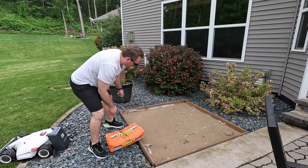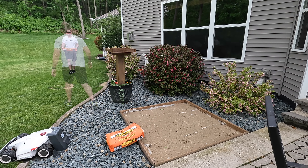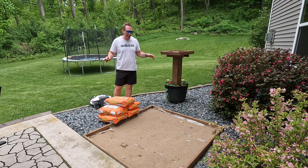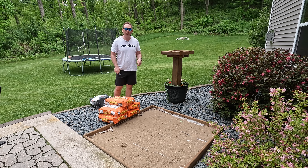I'm going with this crack-resistant mix by Quikrete. It says you don't have to use wire mesh or rebar, so I'm going to test that out. We've got five bags — that's all I feel comfortable hauling in the back of my vehicle for weight restrictions. We're going to pour it in there, see how much we need. I think I'll need about seven. One of the nice things about this dry pour is we're not under severe time restrictions as long as it doesn't rain.